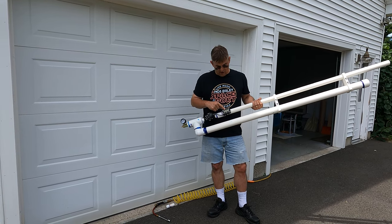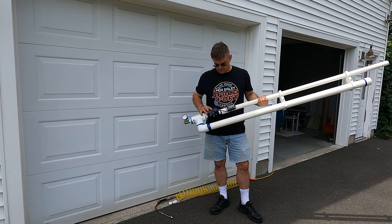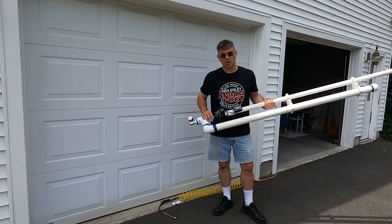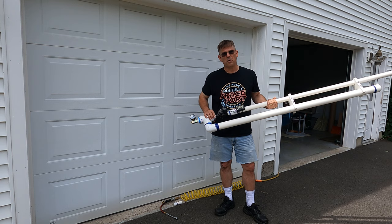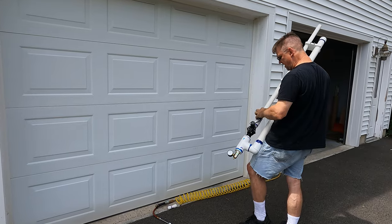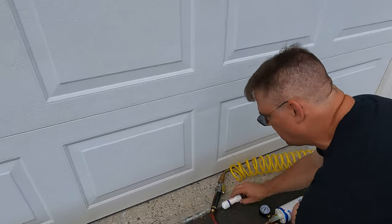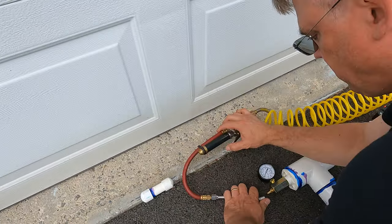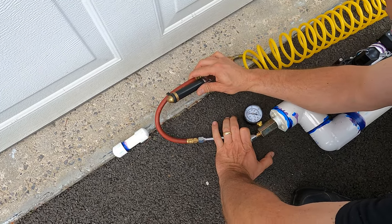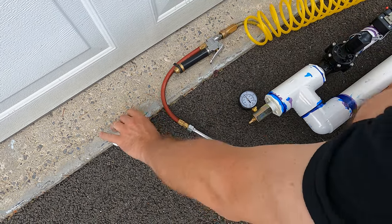All right, so we're back. We have our firing mechanism made here. We have an arming switch. We have a fire switch that's wired up to the sprinkler dump valve. And I've already pressure tested it. There's no leaks, works good. Let's charge this thing up. We'll put 50 PSI in it and we'll see how she does. Arming switch off. That way we don't accidentally hit a button and fire while we're filling. And we'll go to about 50, give or take. Here we go, 50 PSI.